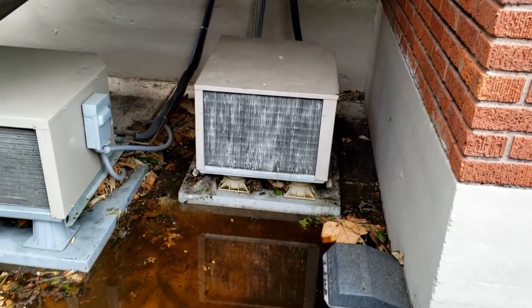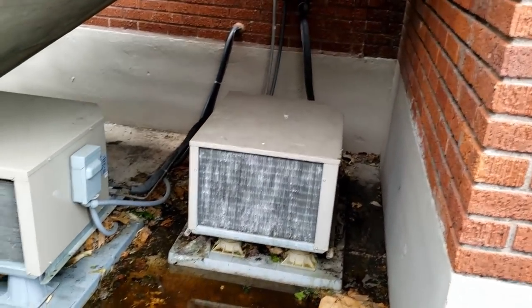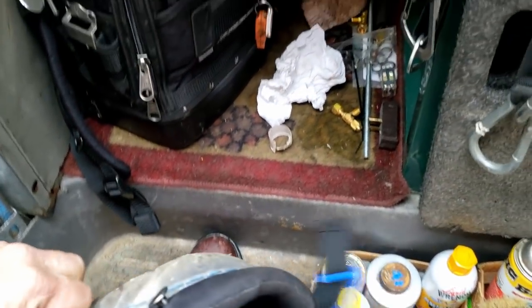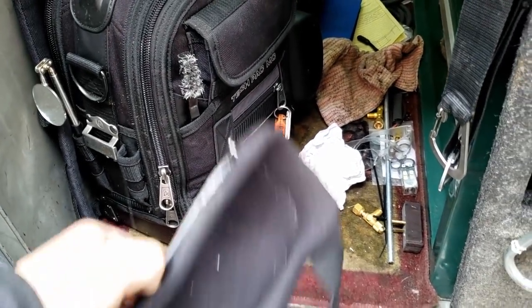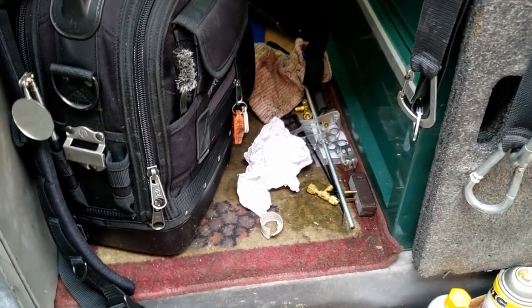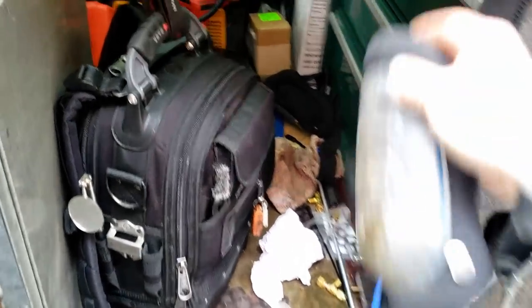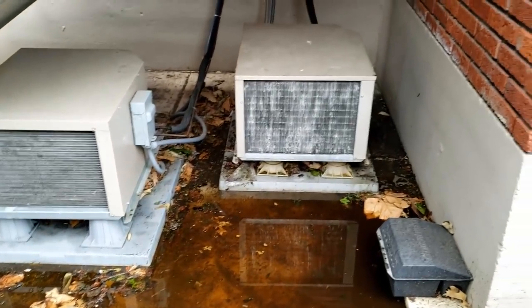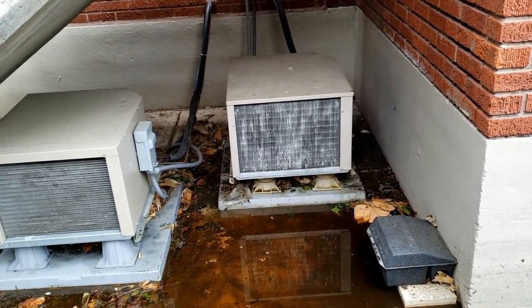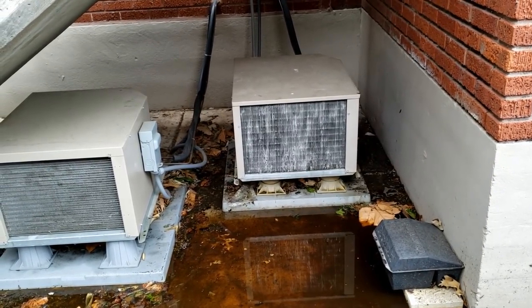It's not, you know, still ain't the right insulation, but I told him save your money, check it out, make sure that it's freezing up still, and if it does, fine, we'll have the insulators come out and do it. And then otherwise everything's a lot better than what it was. We got a leak repaired, we got the superheat set right, coil cleaned, the coil straightened, and everything's working pretty good. We got that ice off the end of the coil.